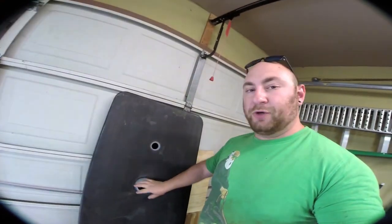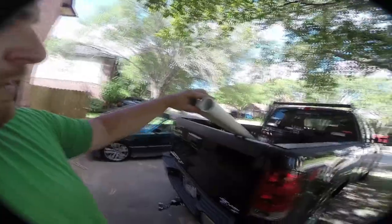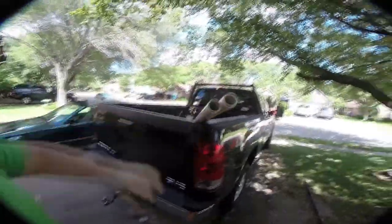Then this will be our main drain, and I'm gonna adapt this 3 inches to 1.5-inch PVC, which is gonna be the drain system for all three drains. And so I bought a bag of PVC fittings. You can see here, some of them are already wrong, but that's why I bought a whole bunch of them, because I'm gonna take back what I don't need, and I'll probably have to make another trip tomorrow to buy a whole bunch more. And then over here, we just got 20 feet of 1.5-inch schedule 40 PVC to get us started.